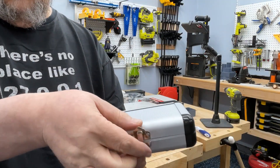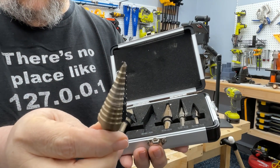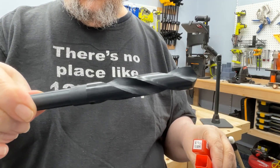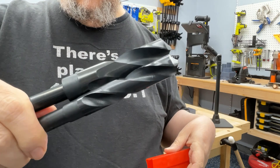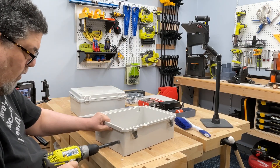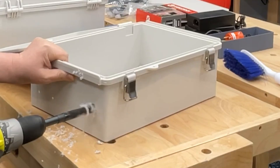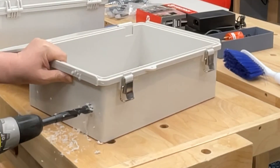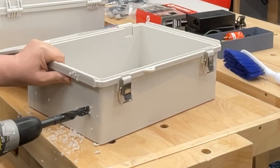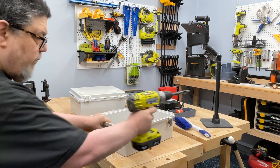When I started doing this the first time, I used step drills, which proved to be really quite the challenge to both get accurate and get through. They were a real fight. So I went off and bought drills that actually fit the size of these holes. This is a 15.5 millimeter drill bit used for the power pass-through, while the Ethernet pass-through connector uses a 20.5 millimeter drill bit. The drilling process takes a little bit of work because the blade cuts into the plastic and leaves plastic shards that get caught on the drill bit and halt it. So there's a lot of start and stop. For the smaller drill hole it wasn't too bad, but the Ethernet pass-throughs became quite a challenge, requiring careful drilling and a certain amount of careful touch to make it succeed.